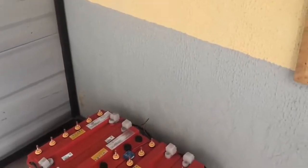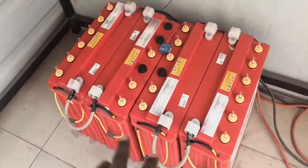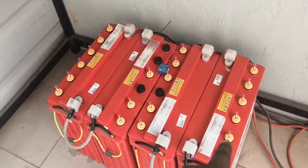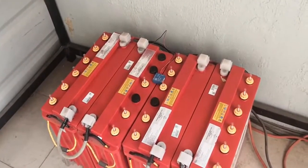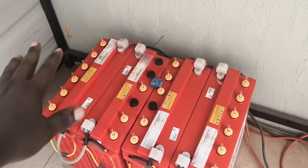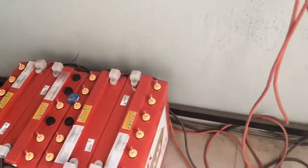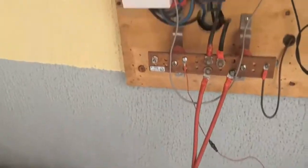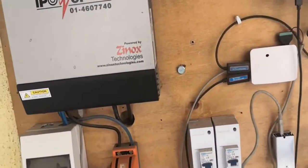These batteries are connected series-parallel — so you have 24 volts, then I parallel the output. What I did for the capacity test was to decouple them and parallel them, then ran a capacity test on each bank separately. They held their own. I just finished carrying out some maintenance — charge equalization and whatnot.